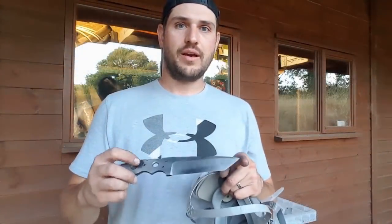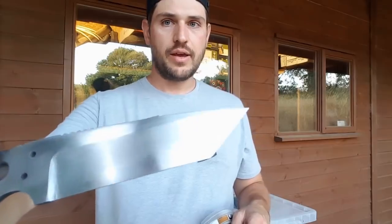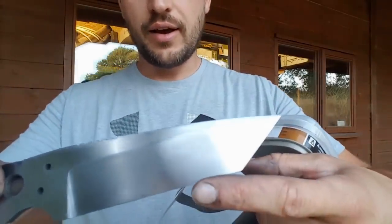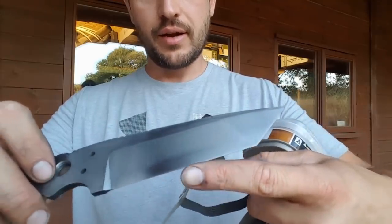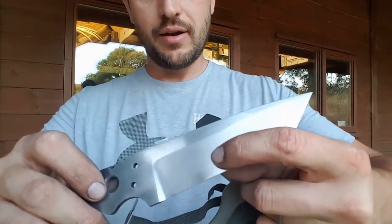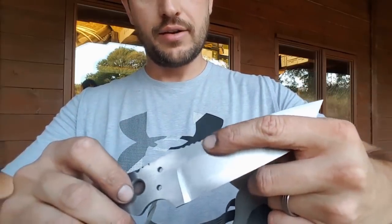I've finished up the hand rubbing down to a 400 grit. You can see on there that the heat treat line is polished just a little bit more than the rest of the blade. So again, basically I think I've got hard metal in a nice band pretty much up and around here, and then gradually getting softer.